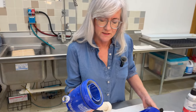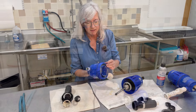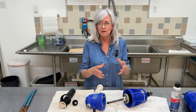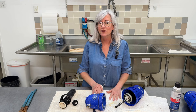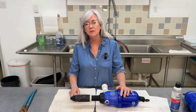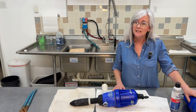You can see inside here — look inside of there, isn't that terrible? It's all filled with gunk, and that's going to clog everything up, so I need to get this cleaned up. After I get it cleaned up, I like to check all my seals, O-rings, and all the different things. I put a little bit of silicone spray lubricant on it because it keeps all the rubber parts working well and makes sure the thing keeps pumping like it should. All the insides are cleaned up now. I also want to tell you there is a rebuild kit you can get for the check valve down at the bottom in case that's not working right — it's an easy fix. So I'm going to put this one aside, take the second one apart, get it all cleaned up, and put them back in production.